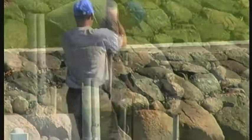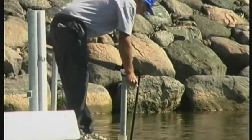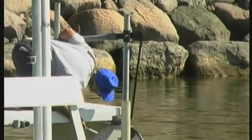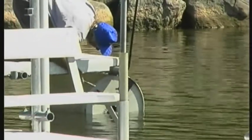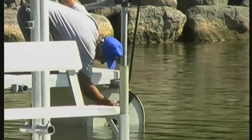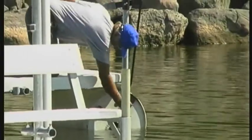The leveling jack is used to raise the existing section by placing the hook of the jack underneath the frame pipe. Tighten the 2-inch sleeve set screw, then push down on the straight handle of the jack. When the deck is adjusted to the desired height, tighten the set screw to secure the vertical pipe to the bracket. We recommend that you raise or lower the dock until the bottom of the barrel bracket clip is flush with the waterline.